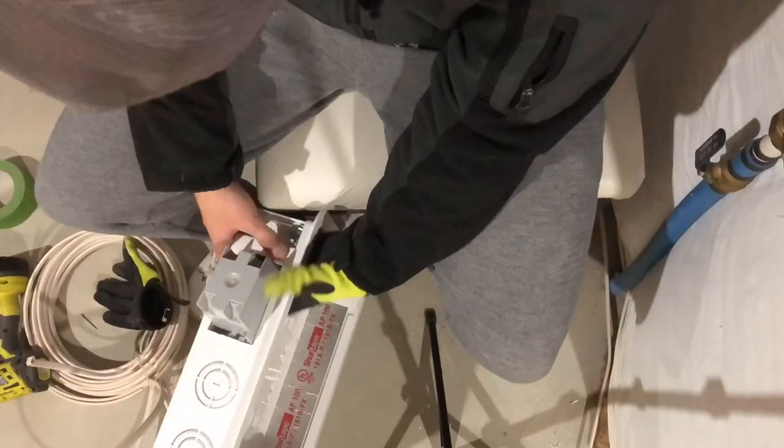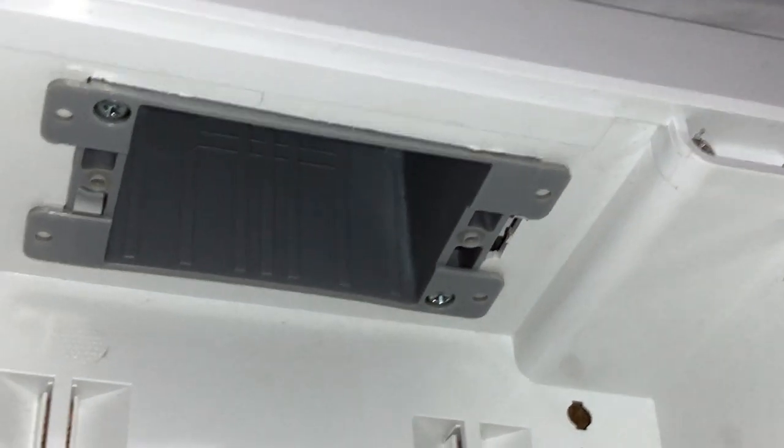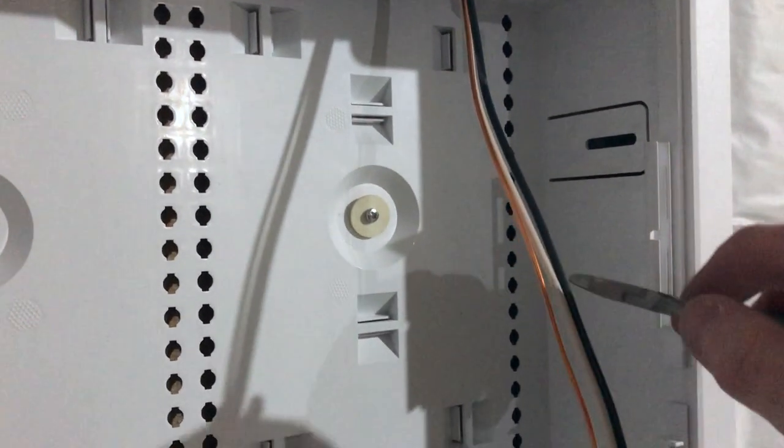When pushing the gang box up, make sure those tabs are tucked out of the way so they can clear into the hole. I noticed the hole wasn't quite big enough so I cut it a little wider. After way too much time getting it to the exact right size, I'm finally able to run my wire. I pre-opened a tab so I can shove the wire right in, then cut back to where it enters the box and give myself about six inches of wire to work with.